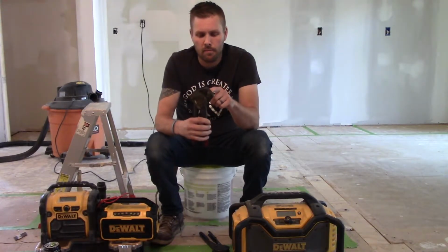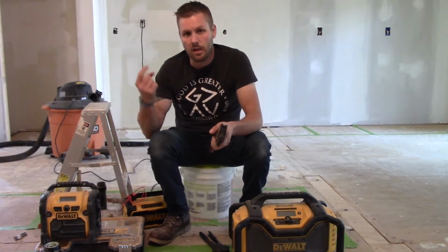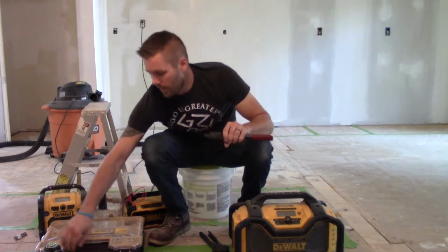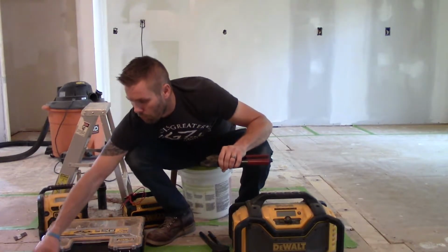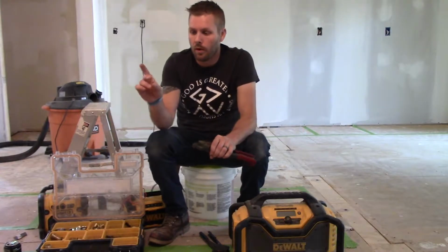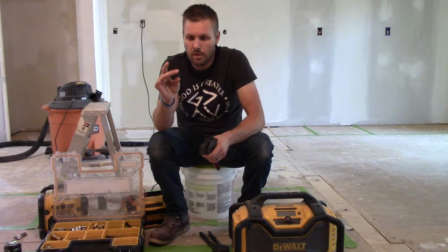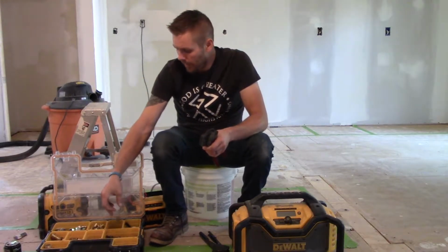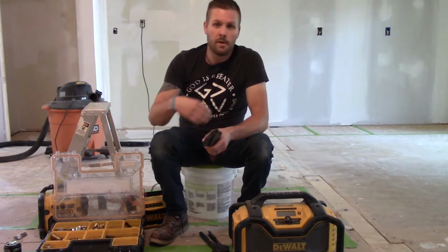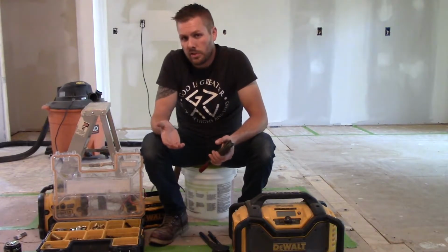These are a type of ring that, you probably saw them in the video, but they are a solid copper band. And when you crimp these, it crimps and compresses that band all the way around. So I prefer this style much more. The tool goes completely around it, and it's a copper ring that compresses the entire pipe. I also prefer using brass connectors instead of the plastic ones. I don't think there's a wrong answer here. It's what your preference is.